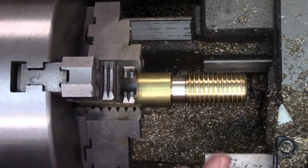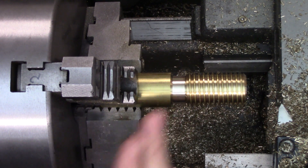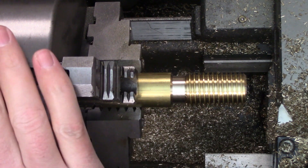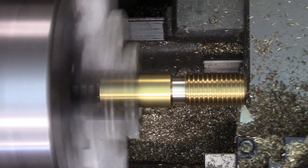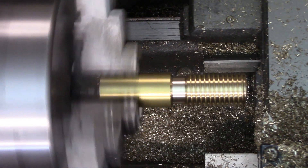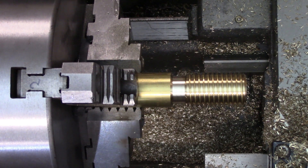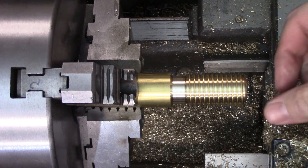I really wish I had thought of that, so that's what I'm going to do now. My half nuts are actually already engaged. All I need to do is turn on the machine and it's going to start feeding, then I'll stop it at the thread relief and do the exact same pass pattern as my other samples. That wasn't that bad actually — that was way, way better than the way I did it before. Thanks altruisticad2017.